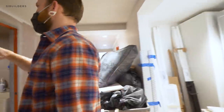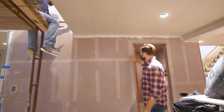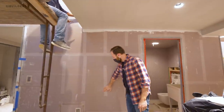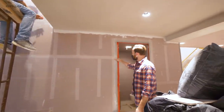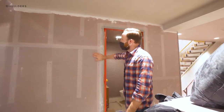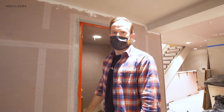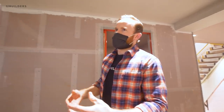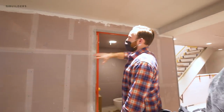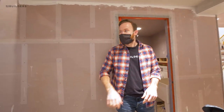The guys are doing a great job on install — site is really tight. The majority is installed and they're starting work in the living room with some auxiliary cabinetry. The plasterers are continuing with their prep — everything gets mesh tape rather than individual screws, running a strip at every seam. Even with our easy-access plastered jambs they're running two layers of mesh tape for extra security, binding everything together. The chalk lines are all snapped and this wall will be plastered next week.